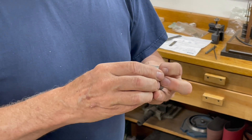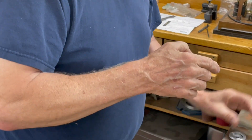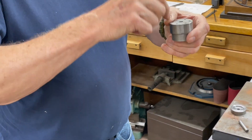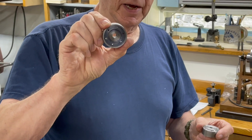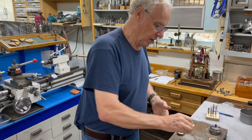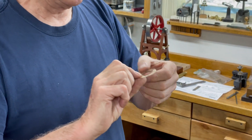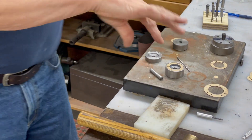I would take the bottom die, lay out the holes on it like this, drill all the holes, then put the top of the punch on and turn it over to transfer the holes down through to drill that. So this becomes the drill jig for the cylinder head, and then the cylinder head becomes the drill jig for the cylinder. If you match mark number one hole — and match mark the cylinder the same way — it all goes together perfectly, even if the hole pattern isn't perfect.